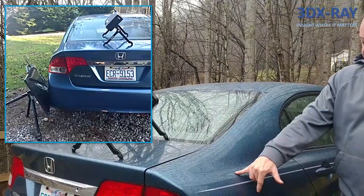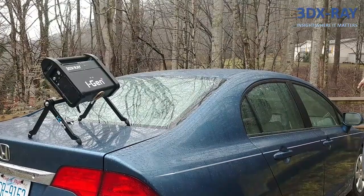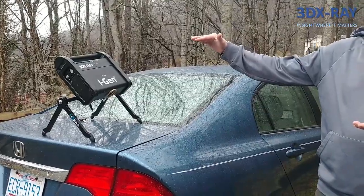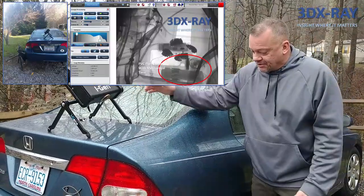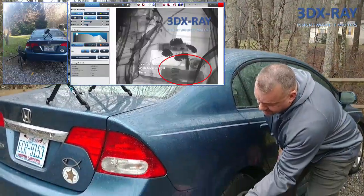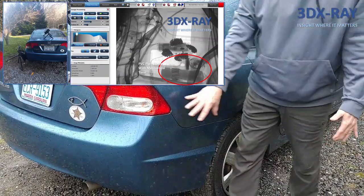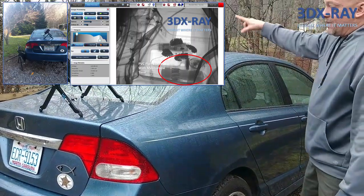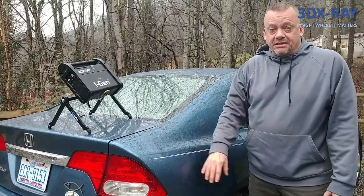If you want to see the side panels of the car — either the back sides or even the front where the engine compartment is — you're wasting your time shooting across the car trying to go through the engine; it's never going to happen. Your only option is to shoot an angled shot with your x-ray panel angled at the side, and you can shoot right through and see what's inside the entire cavity — the same approach works all the way around the car for imaging what's potentially inside those panels.